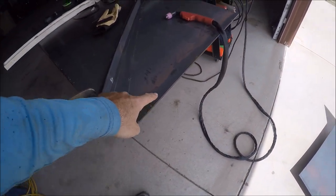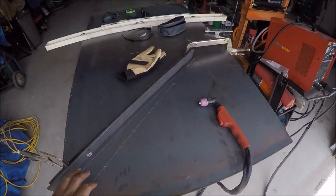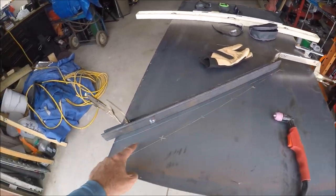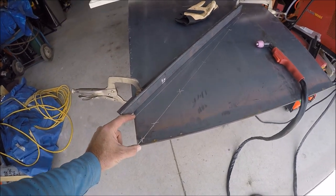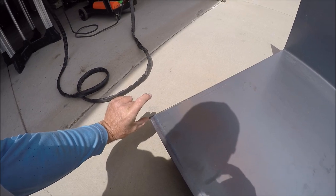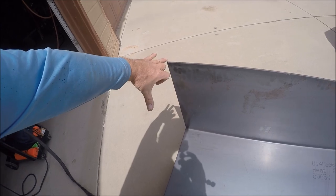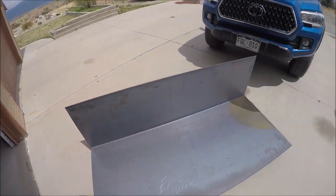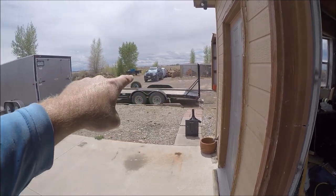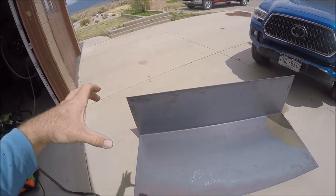This 30 inches should match that right there pretty closely. What I'm going to do is cut it here along this solid line — not the X line, I decided not to do that. I'm going to have this front edge stand up right here so I have a little more support along that front edge, and then it'll taper up to here. At 8 inches it'll flatten out. This top piece will be 8 inches, and I have some 1 and 1/8-inch, 8 inches wide flat — that's a 20-foot stick. I'll use that for a piece across the top.